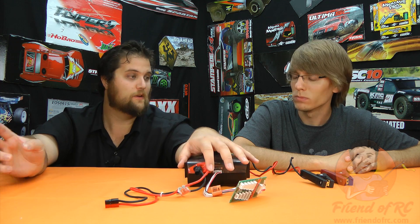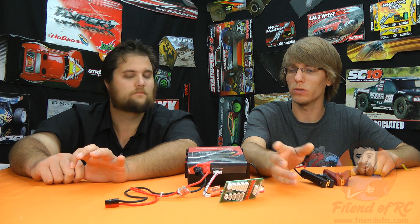On top of that, balancing. Most chargers, when they're charging up the packs and a cell is a little behind, will stop and drain that cell down to level off, then continue on. This balancer unit actually acts as a charger within itself. So if there's a battery that's behind, it's giving it extra power to catch up. What that means is a lot less time — you're not waiting for the thing to balance, and it does it extremely quickly. Almost any LiPo plugged into this charges in less than half an hour fully. When it's done, it's done, because it's adding more juice to balance as it charges. When you're hooking up large packs with a lot to balance, you don't even notice the balance time because of that extra charger built into the balancer.